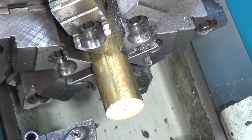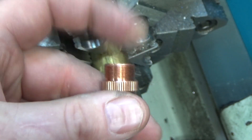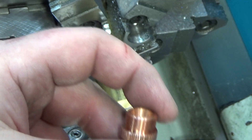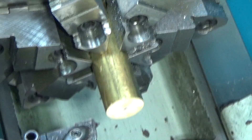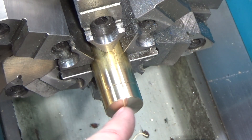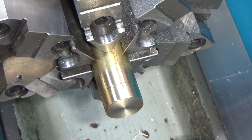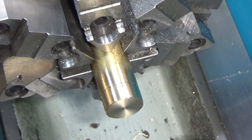We've got to drill a hole down the center of this. I'm just going to clean up the face a little bit and the outside just to make it pretty, and we'll make a thread gauge out of this so that when I make the threads for the new part I can just test those. I could use a thread mic to measure this and see if I get the new threads duplicated properly, but then I wouldn't know for certain if something else was wrong and the threads wouldn't mesh. So first I'm going to make threads that mesh with this. We need to open it up to the final diameter - it's smaller than 0.556 because that's the external thread diameter, so you subtract twice the thread height from that diameter for the internal diameter.